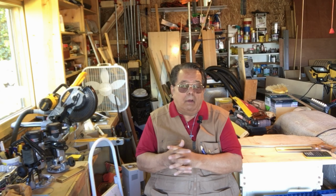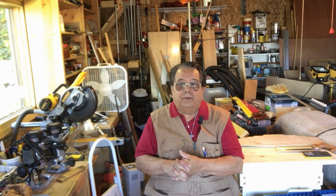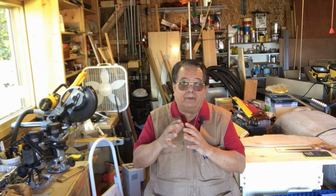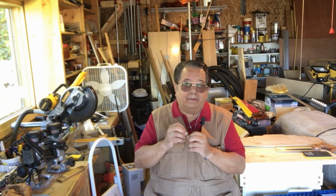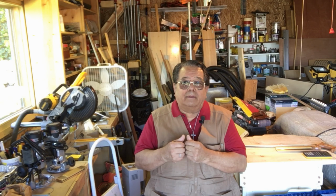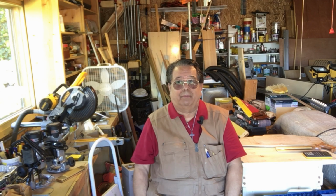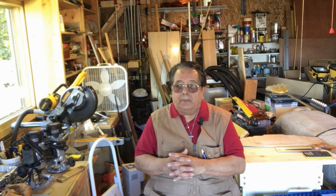It's simple. The only problem is pine is, in a way, difficult to work with if you're trying to dovetail or do intricate moldings. When you go back and sand, you can actually wipe the detail out. And when you're dovetailing, you have to test fit it, and just by going in and out, the fibers will give loose and break. So you've got to be pretty good. Whereas with oak, walnut and pecan, you can jam it in, pound it out, and jam it back in. You do that with pine, and you're asking for trouble. But I don't mind. I can handle it.